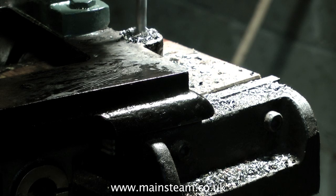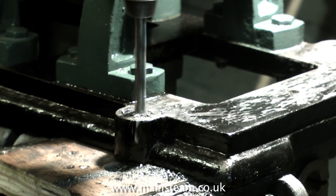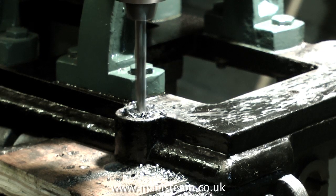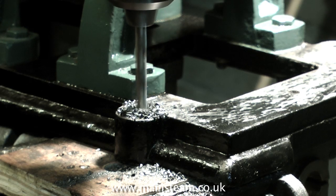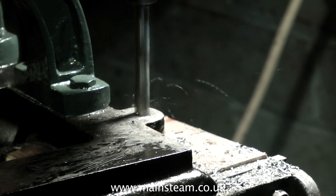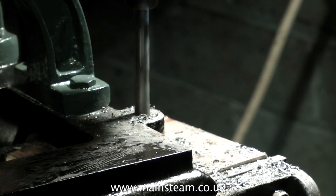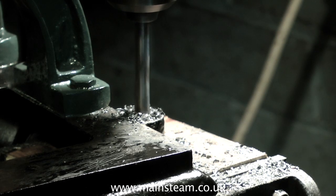Following the centre pop from the centre punch, I went through with a quarter inch drill first, then opened up the quarter inch hole to 5 sixteenths. A good thing about that is if the quarter inch hole was in slightly the wrong place, I could file it round — but I try not to bodge like this, I try to get it right in the first place. Quite unlike the original builder of this engine, who seemed to drill holes just where it felt like at any given time.